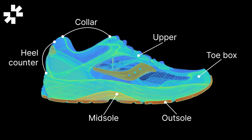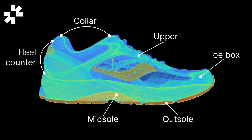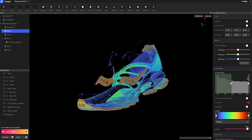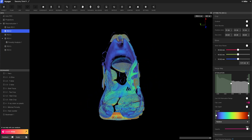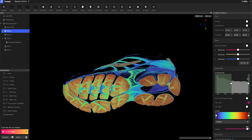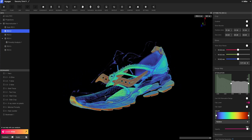What do you see when you look at a CT scan of a shoe like this? The first thing I look at on an Omni9 or any other lifestyle product is where the heel counter is being placed on the inside of the upper. You cannot see it from the outside, and the only way you're able to look at it is by cutting it in half. If we're trying to conserve samples, this is where CT scanning comes in very valuable — I can measure exactly where that heel counter is being placed, because if it's misaligned in any way, it can truly affect the comfort of the shoe and how it performs, and we want to minimize these risks upfront.